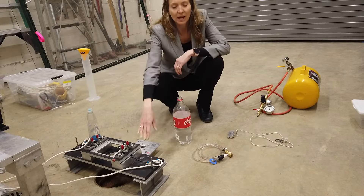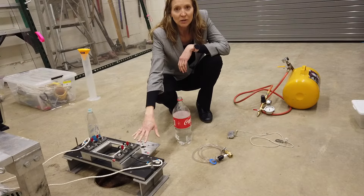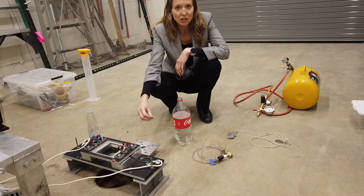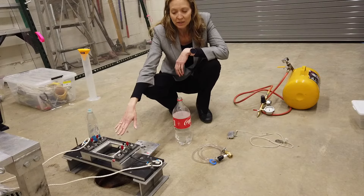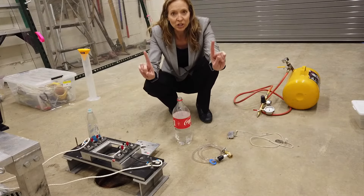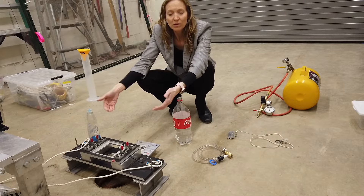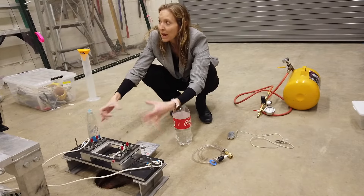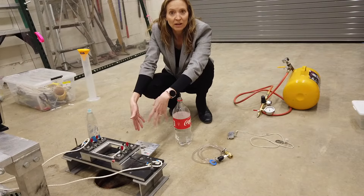To do that, we have a test stand developed with very expensive industry-quality load cells. These load cells use piezo crystal technology to measure very quickly changing forces. The forces are transmitted from the rocket to the test stand through a top plate, which is attached to two load cells — one on each side — labeled in the VI as Force 0 and Force 1. Each load cell is supported on two aluminum blocks and a bottom support plate with a hole in the center where the water and air are expelled.